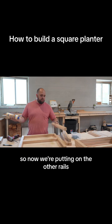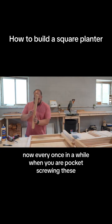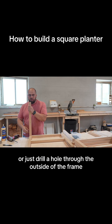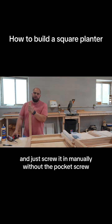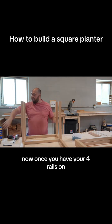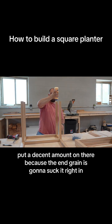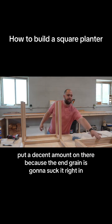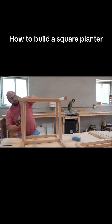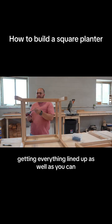Now we're going to put on the other rails that connect the two sides together. Again, put your pocket screws to the outside. Every once in a while when you're pocket screwing these you will hit the other screw. If that happens you can either try to move the screw over a little bit or just drill a hole through the outside of the frame and screw it in manually without the pocket screw. You'll know if it hit because your piece will start rising and the screw won't go further into the wood. Once you have your four rails on, apply glue to all four of the ends — put a decent amount on since the end grain is going to suck it right in. Pocket screws facing up toward the outside, get your first side lined up starting at the top corner, and work your way around with all four screws. And there you have it — the first planter frame.